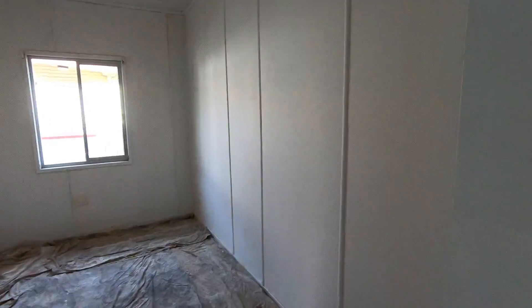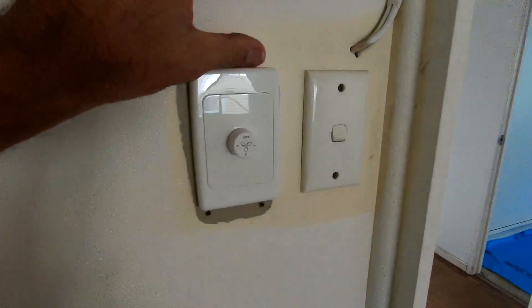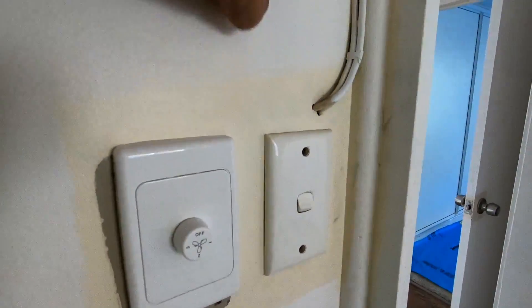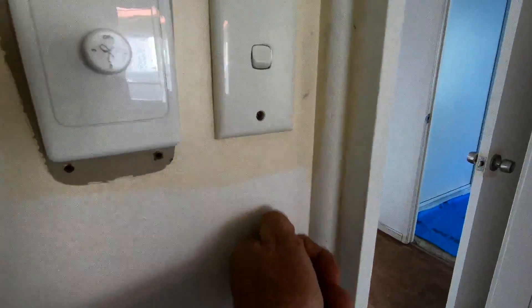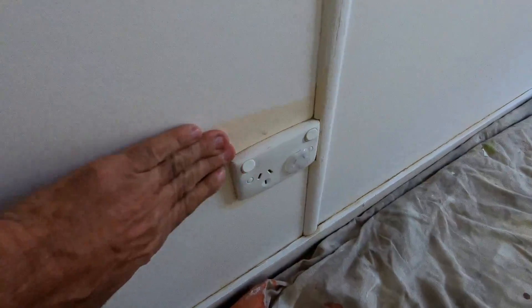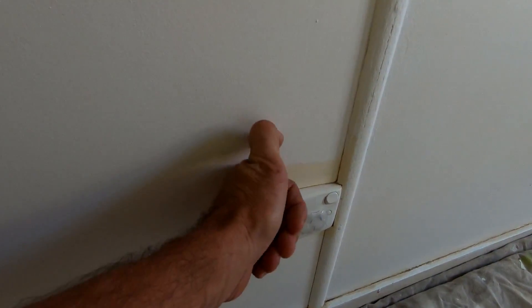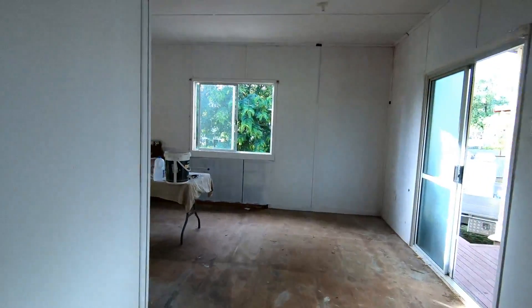I'll find a room — all this was gloss enamel. One coat, no preparation. As you'll see there, that's gloss enamel, very shiny. One coat of oil-based undercoat — I don't care how hard you scratch it, it will not mark. No preparation, no sanding, just straight into it. This is around a PowerPoint, so this is actually a really hard place — normally you'd have to re-sand all this. Watch.